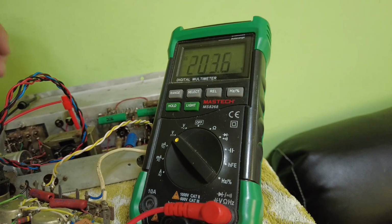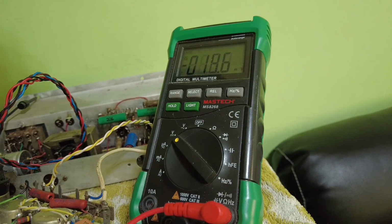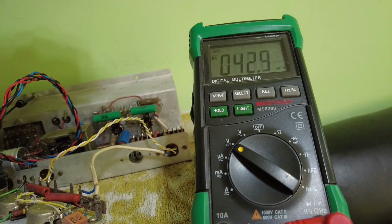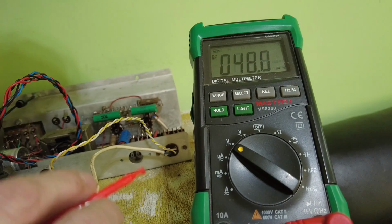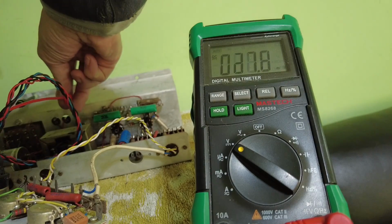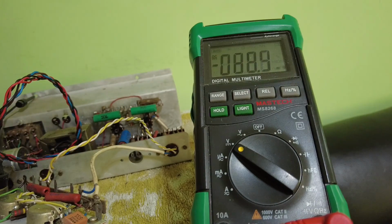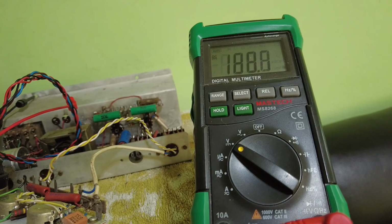Pin 6 is the plate. In actual fact, I'm not using my noddle here, because I'm just looking at this output transformer. It's obviously that yellow wire there. Instead of going to the valve, we'll just go to here. Why not do that? It's easy. Duh, why didn't you think of that before, man? Get that on there, that's good.